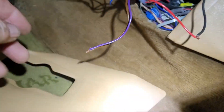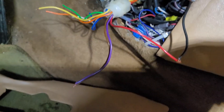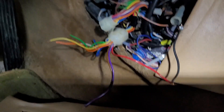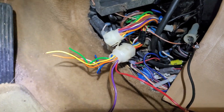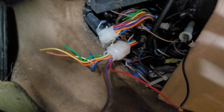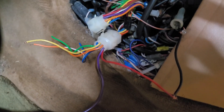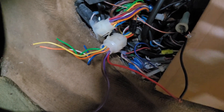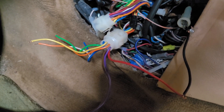To start, connect the red wire to the black wire and the purple wire to the brown wire. This gives you power to the servo motor. Then turn on the ignition switch. The servo is running. Let it run until it stops — that's one direction. In my case, that's going to be the heat side. Because the car is cool, no fans run.